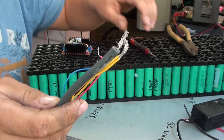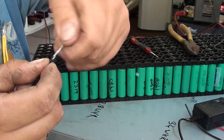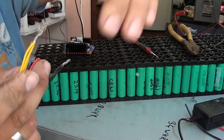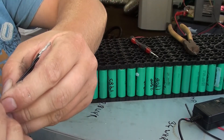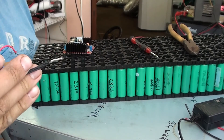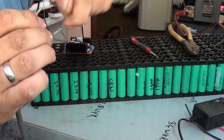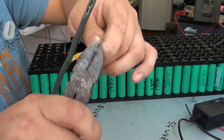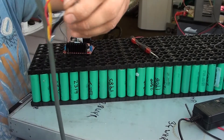First step, we need to bare up the pairs of wires that come out of the Xbox. For instance, you get three yellow which is 12 volt positive, three black, and your red and blue are your actual switching wires. We're not going to worry about that for now — the switching wires we'll just twist them together. There's not going to be a switch — get them twisted together and shorten them up a bit like so.